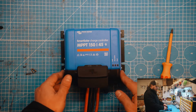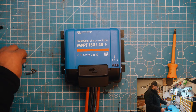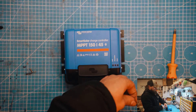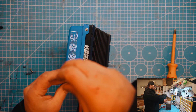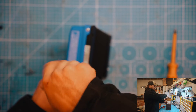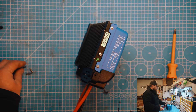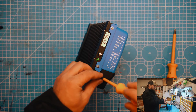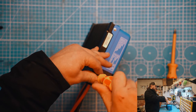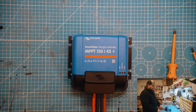Once you put the wire box on, there's plenty of space below inside for your VE.Direct cable to plug in. When you put this on, you then have two final little bolts with washers — they go through this hole here into a threaded hole on the side of that metal frame you put in at the start. That goes in there and screws into that bracket. Again, you're not tightening that crazy tight because it's just holding this plastic piece in place.